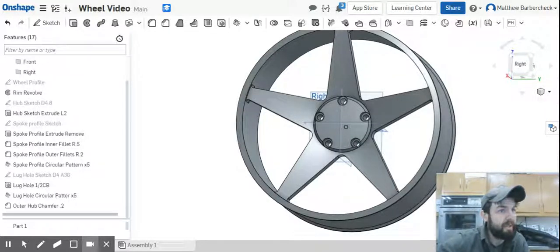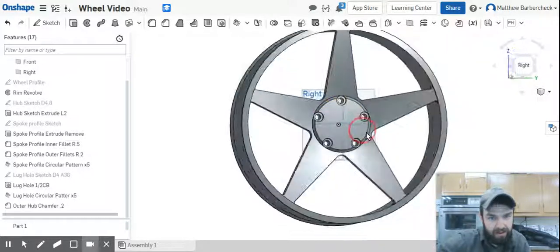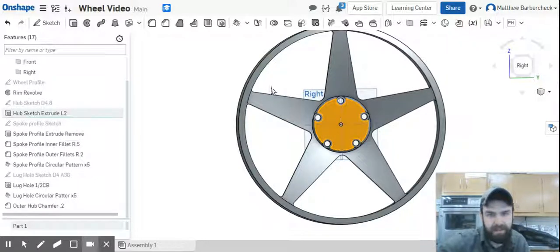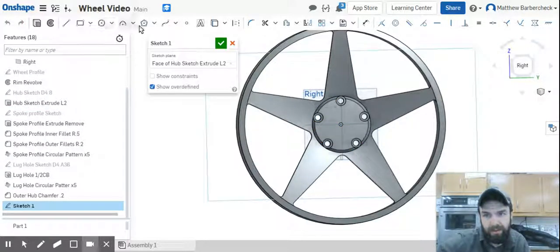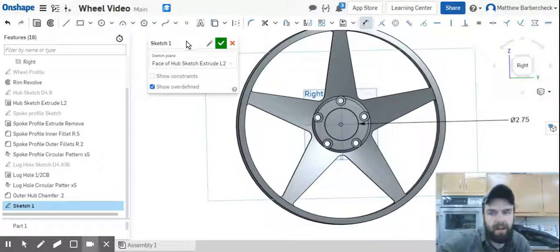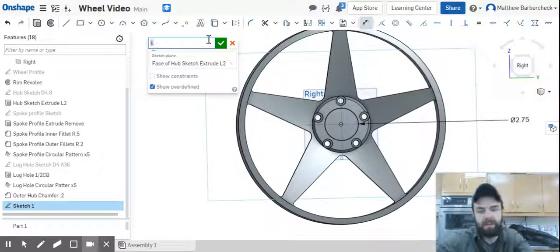So now what we want to do is give the inner hub a little bit of a recess. So we're going to sketch on this face again. And we're going to sketch a circle right here coming from the origin. And we're going to give that a diameter of 2.75. Right, and then we're going to name that inner hub sketch